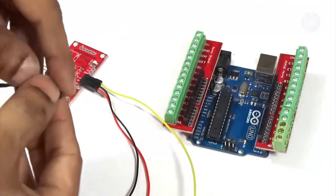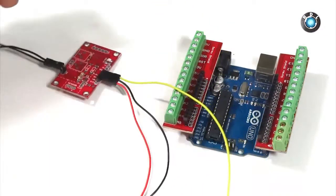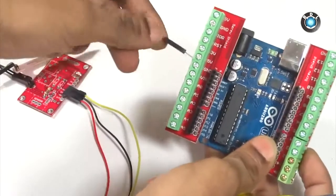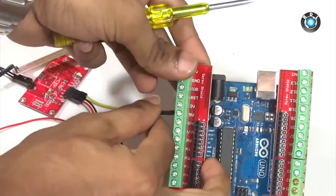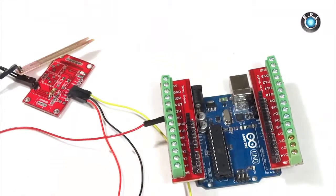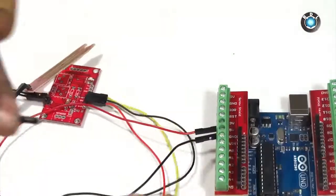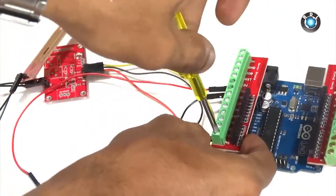Let us connect the electrode PCB to the sensor board with the jumper cables provided in the kit. You can always use a lengthier wire if required. The other end of the connector cables of the sensor board are still free — let us now connect these to the Arduino screw shield mounted on the Arduino Uno. The red wire goes to the +5V of the screw shield, the black wire goes to the ground, and the yellow wire to A5 of the Arduino board, since in the code I have used analog pin A5 as the input pin to read the soil moisture analog voltage.